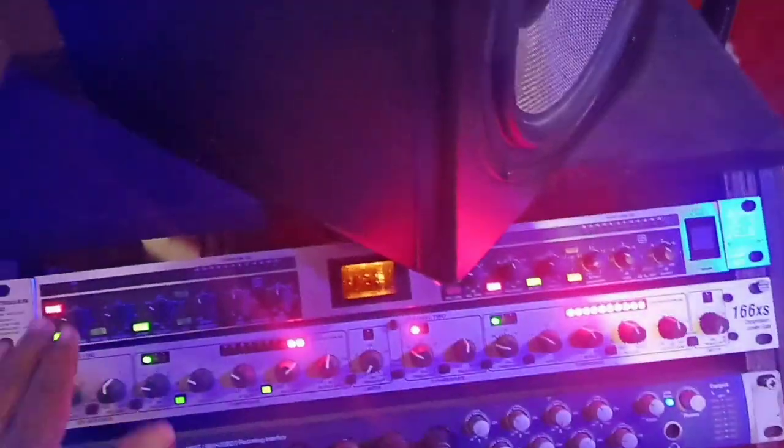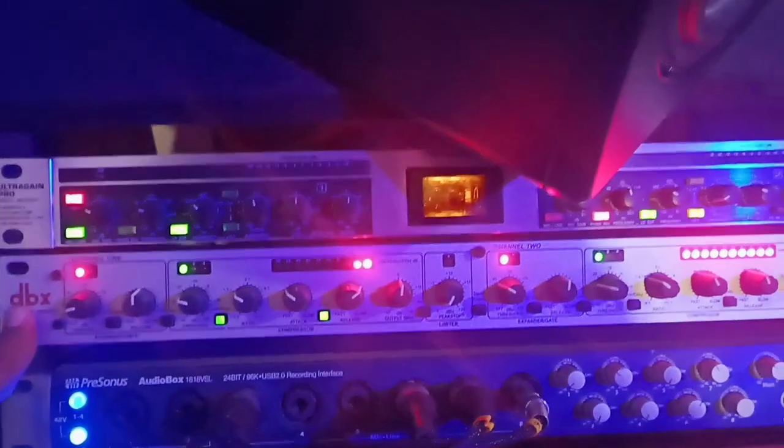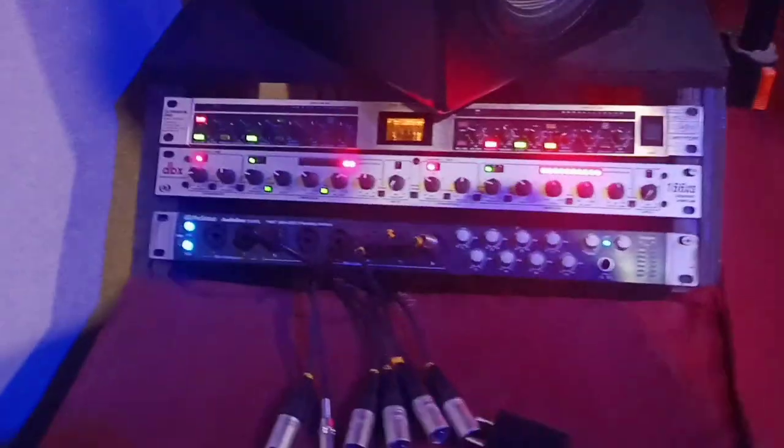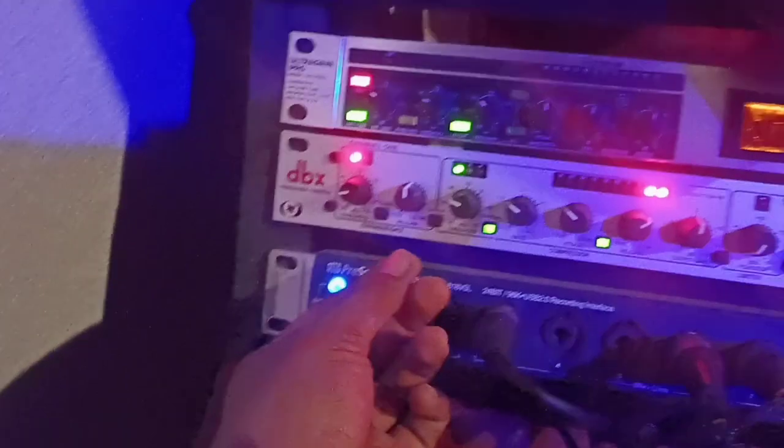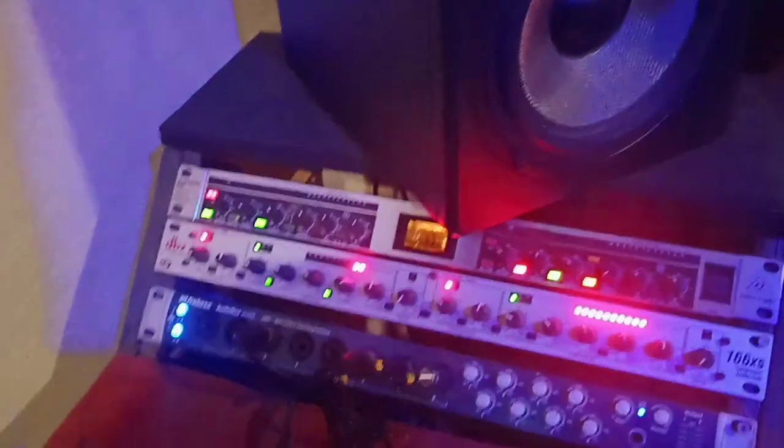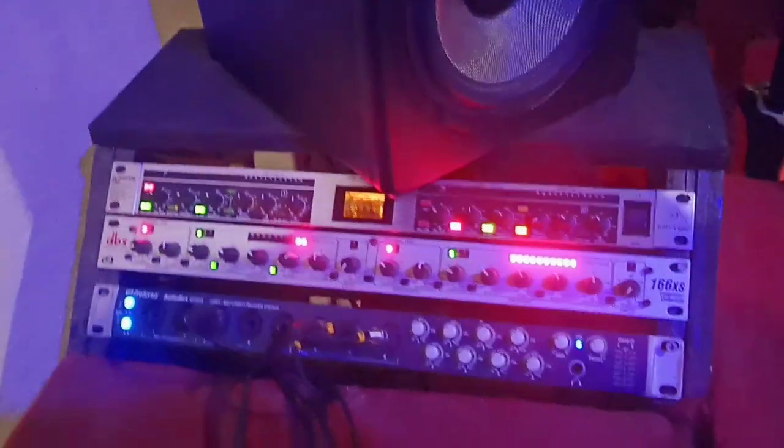The signal goes through a side chain — first through a beautiful two-channel tube preamp, then into a DBX compressor. The reason for the preamp and compressor is to improve quality and clear out room noise. Even with soundproofing you'll have room noise, especially in our room, which is a big jam room where we can fit 20 people and record orchestra. I set the compressor threshold to about 15% with a bit of release to manage the hiss noise — the quality comes out amazing.